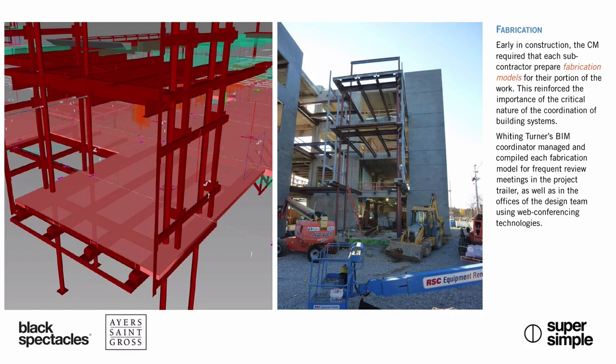Here you're talking about the prefabricated pieces. How much of this is prefabricated? Is it like this entire section here, or what's actually prefabricated here? Yeah, we call them outriggers. Those whole outrigger sections were all shop fabricated and then welded in place. This whole section here, and then the one below it, and so forth. Yep, absolutely. A lot of that stuff was all shop-fabbed and then bolted and or welded in place onto the main structural components.